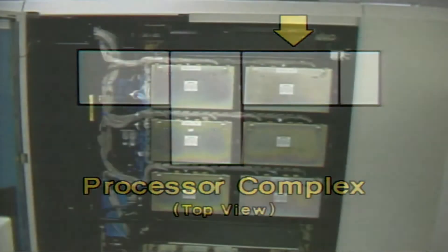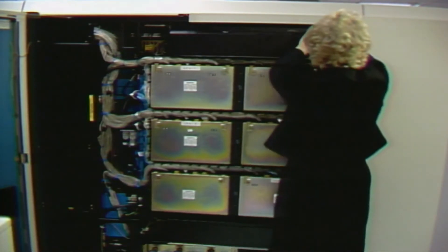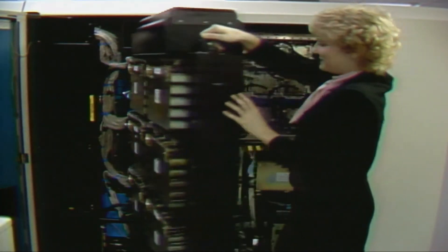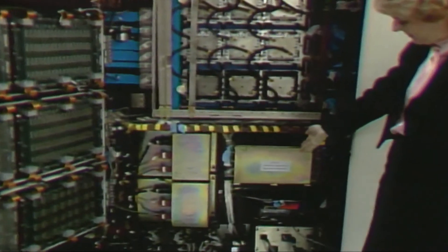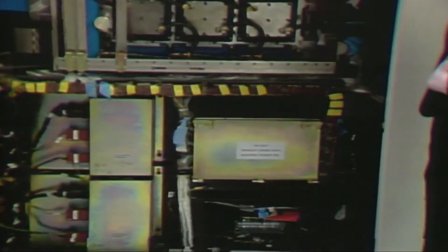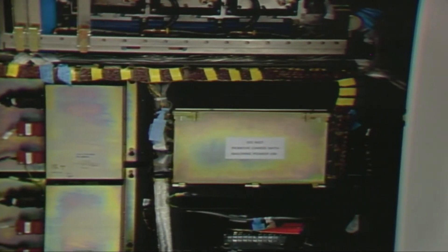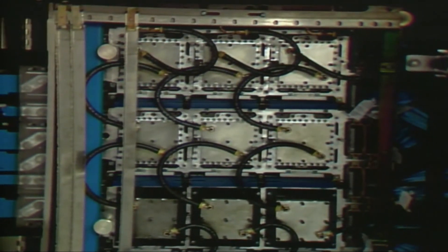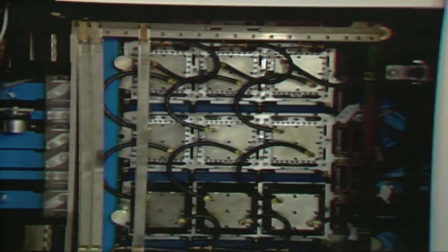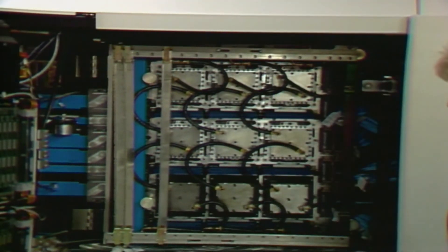This is the B-gate located in the rear of Frame 3. It contains half of the total number of channels installed in this processor. This is PTCS3 and it is located on the C-gate. The pin side is accessed from the other side of Frame 3. This TCM board contains the channel control element circuitry. There is a channel built into the frame that is used along with a special tool to remove the TCM board.